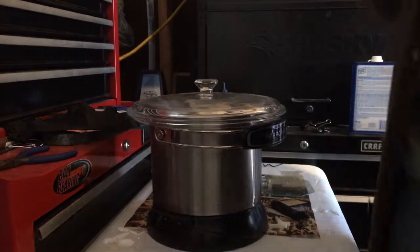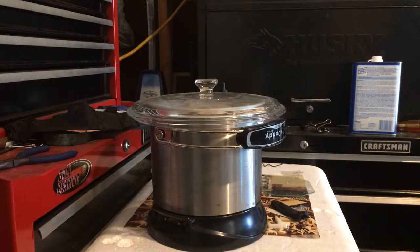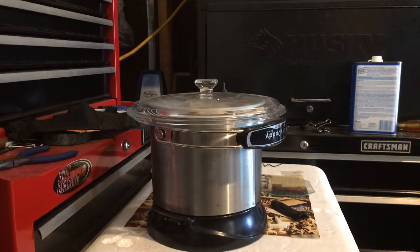I think that pretty much does it. We'll give it about 6 minutes and see where it's at when we come back. Now because of the fine point and tip on the beak of this raven, I may actually break this down into two separate treatments. If I treat it 10 minutes to get rid of all the lines, I'll end up deforming that tip of the beak. But if I give it 5 minutes, let it cool down for an hour, then give it another 5-minute treatment, I can polish out all the layer lines and give it the shine and gloss I want without softening the whole model too much and affecting the shape of the beak.